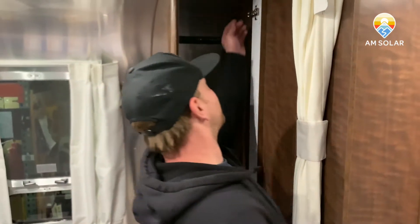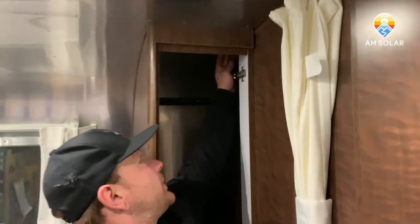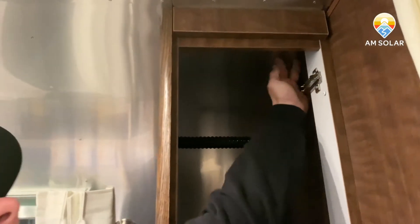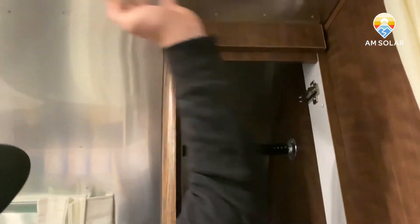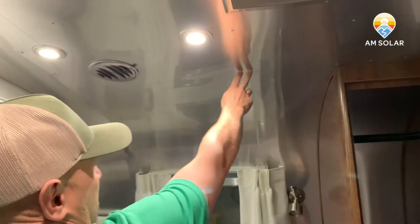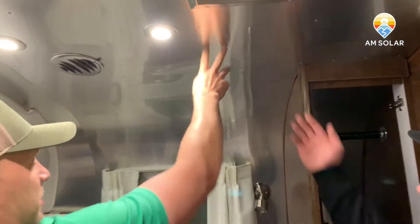We're going to do this very discreet so you don't see any cables or loom. We're going to go in the corner right here on the outside of the rivet. For that reason we have ducting going through the ceiling right here for the AC, so you've got this line of rivets right here and you do not want to drill anywhere on this side of that line.